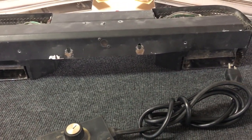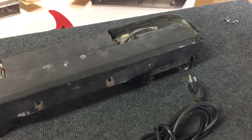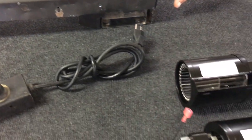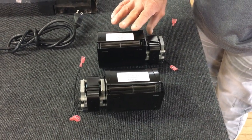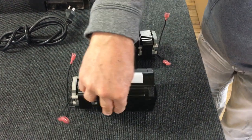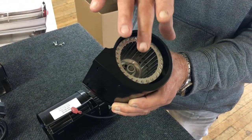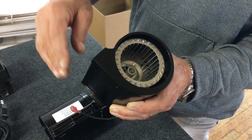We're going to be replacing the old blowers with our replacement blowers that I've got sitting here. The difference between the OEM and our blowers is we feel that we've got a better blower. Our blowers are all ball bearing constructed. If I turn this one around, instead of a composite wheel, we're using an all aluminum wheel. It helps increase airflow and it alleviates any problem if you've got hot ash going in there — it won't melt the wheels.